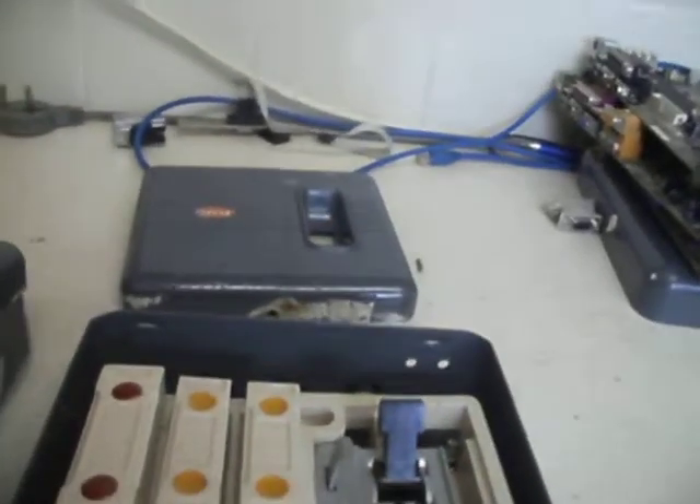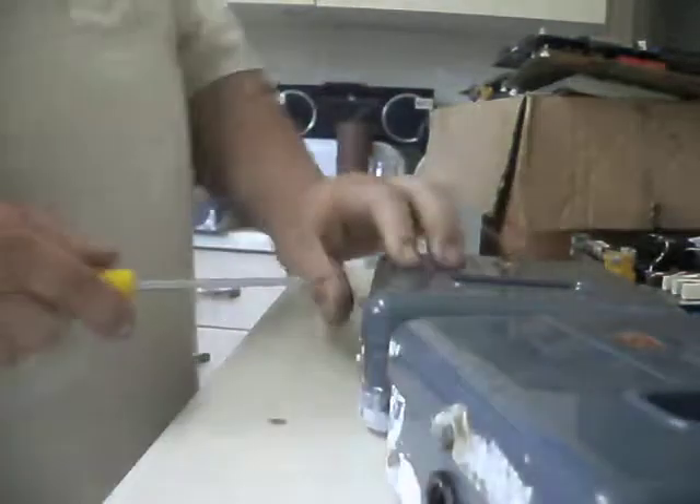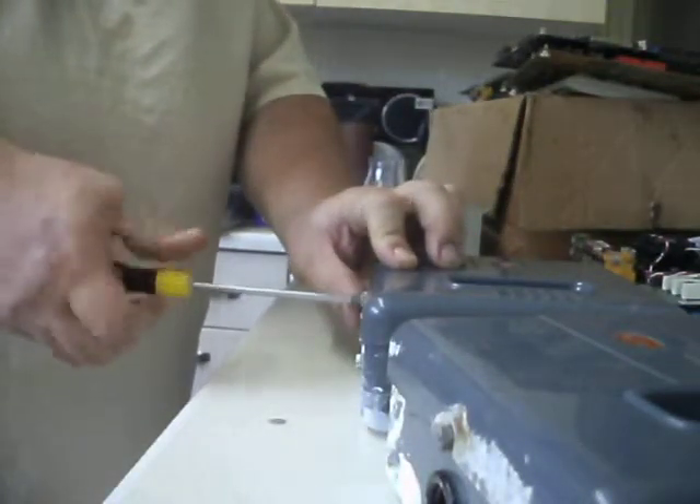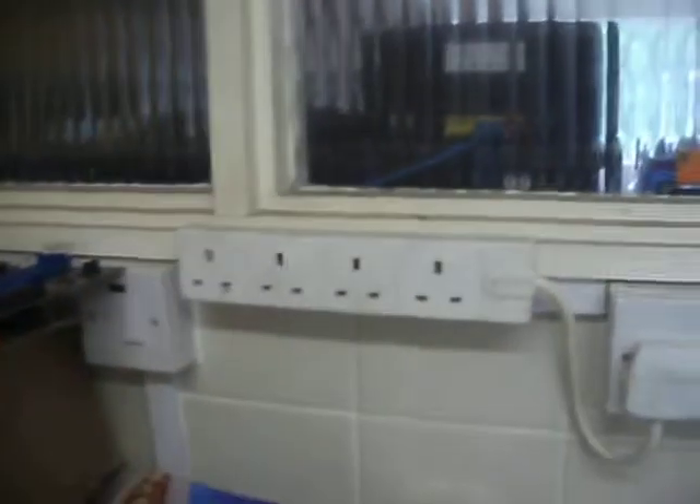Not the best idea if you're using power tools. I mean, if you're just running a couple of shed lights or something, then you could probably get away with still using a lot of these, but I really would not recommend it if you were using power tools. Because ideally with power tools you need circuit breakers for your own safety. But if you have got one of these and you're using your home or your workshop, then I'd recommend buying one of those plug-in RCDs for your tools. So you just plug the RCD into your power outlet, and then you plug your tool into the RCD. Then you're fully protected.